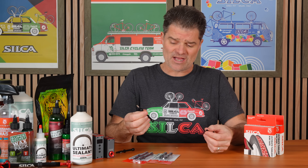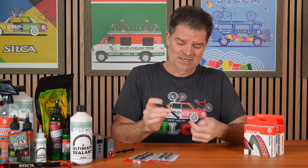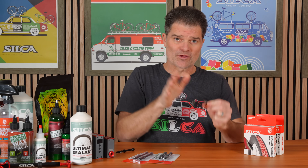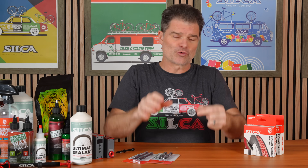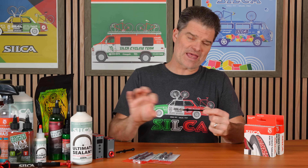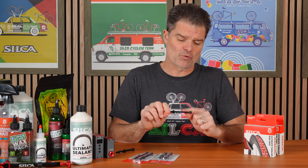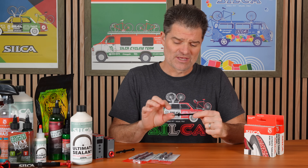So this is essentially a very high-quality, fully CNC machined from bar — not from extrusion. One of the things we noticed with extruded ones is that when you extrude aluminum tubing, there is a knit line or seam where the soft aluminum has to come back together and rejoin, and that can be a weak spot in the tube. These are machined from a rod and then gun-drilled, which takes a little more time but makes for a stronger valve. It also allows us to make the wall thickness a little bit thinner at equivalent or even slightly higher strength than normal.